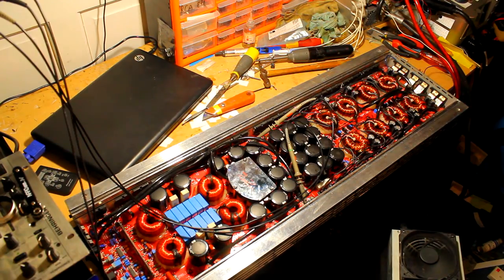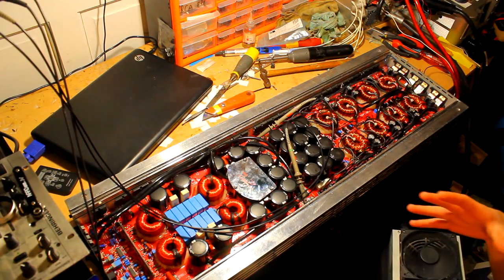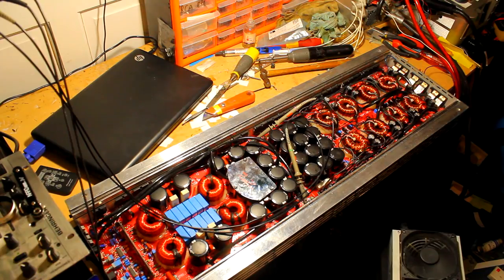And I'll leave it on for a fair bit of time because obviously we won't be anywhere near clipping, just to make sure that the amplifier is happy doing some relatively decent clamped power. Obviously a 10k amplifier, when you use it on a reactive load with a speaker, won't do anywhere near its full 10k of power. There will be impedance rise and it will do less power. So if I can actually bench 4-5k out of this, then that's getting near-ish to the power that it will legitimately do wired up in a car.